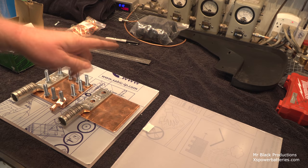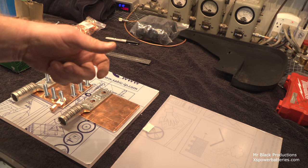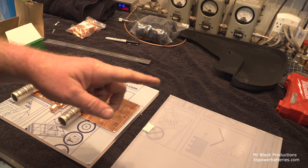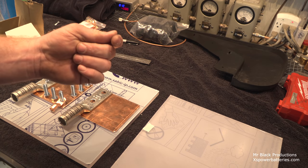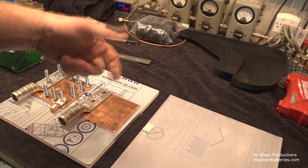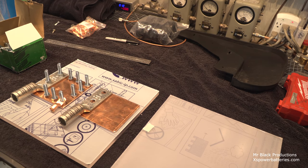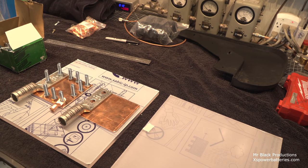We had to go along the length of the frame of the truck, tuck over the frame, in between the frame and the cab. We followed the stock wiring harness and the cutoff. I had to go back by the transfer case, or across to the transfer case, and then hook up. And then it's between the gas tank, which is plastic. It's got heat shields all the way around it. So it rides that heat shield all the way to the back, and then it crosses back across and then comes out the floor back this direction. There was no other way to do it.